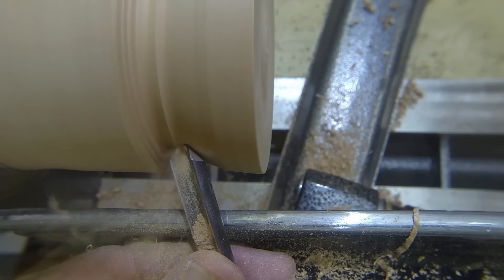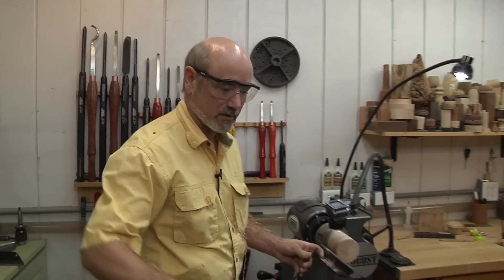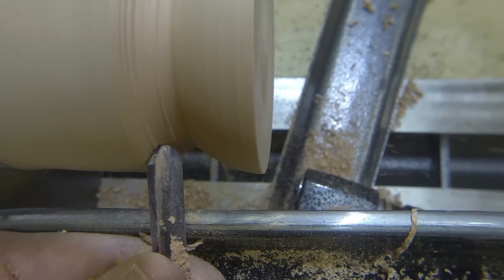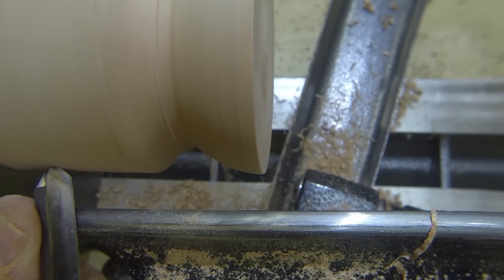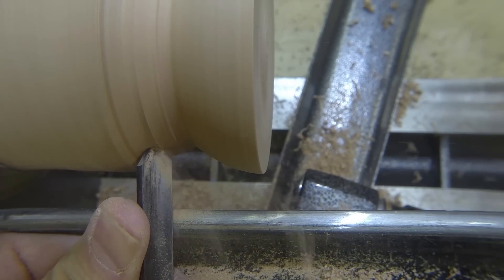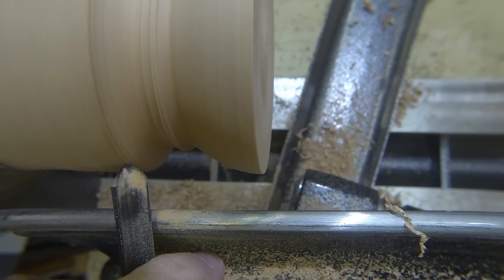Aesthetically, I don't want a flat side because I'm going to need to be curving as I come up out of the top. So the lid's going to look a little weird compared to a lot of lids you'd see, but that's the look I need to make it look seamless. As I make this cut, I have my thumb up here really tight to keep it from kicking back — that's a big skate. So you want to bring the tool like this: it starts to cut, you rotate it open, and it works. The point's going in and now you rotate it open. You don't want a broad edge touching the wood because it wants to run across.